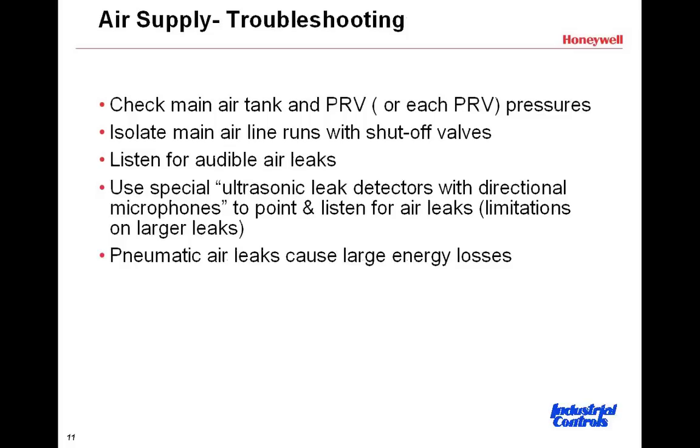In terms of troubleshooting, we typically look for the symptom first. Are you having an issue with controls on a certain air handling unit where you can't achieve, for example, a full economizer open damper? If you can't achieve the pressure needed at the equipment being served, that might be a symptom. If you walk into a building and every zone is in full heat — knowing that heating valves are typically selected to fail open — that's a symptom. Building owner complaints and comfort issues might prompt you to look at the instrumentation first, where you'll hopefully see that your main pressures are low, then go back to the equipment room or the local point of pressure regulation.